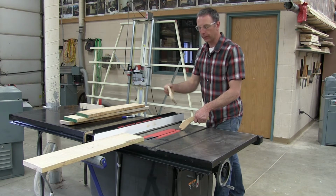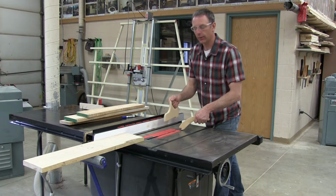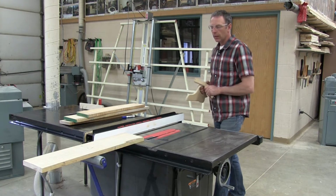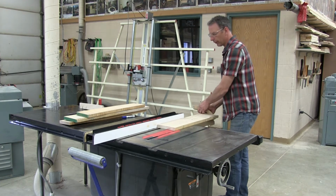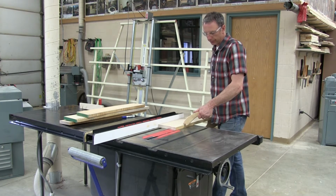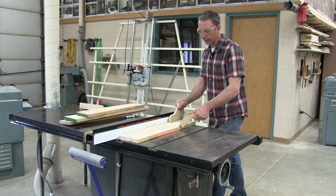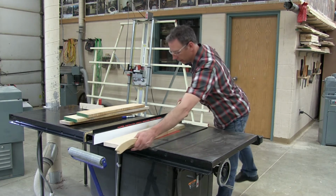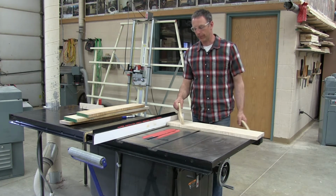But you have to clear the blade, because if you stop where the blade is moving, it can vibrate back and forth, kick back. We don't want that. Now sideways kickback happens when the board comes away from the fence, and that's what this prevents. It prevents it from going sideways, and it keeps it down. So if let's say it comes away from the fence like that, it can grab that blade on the side, and then it will pivot back here and then come this way like so, and then it'll head in that direction. Okay?